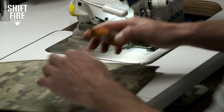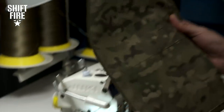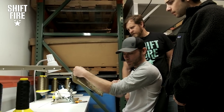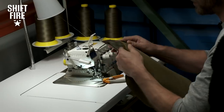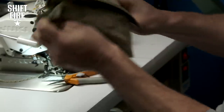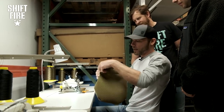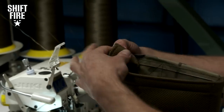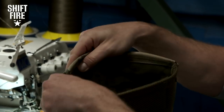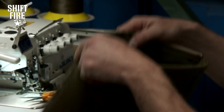Just clip that off — and this is what the inside of our plate bags are going to look like. You've probably seen this configuration of thread on the inside of a t-shirt. This is what an overlock stitching machine does — closes it all off. So when the plate bag is turned right side out, the plate running in and out is going to run along this sealed edge and not along a bare edge with frayed threads. We chose to go this route instead of using a binding — that way it's less material, less weight, less bulk.